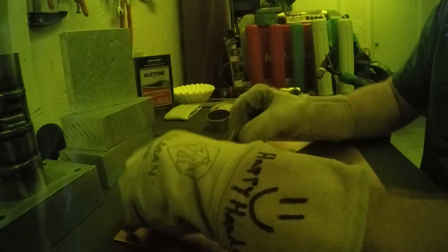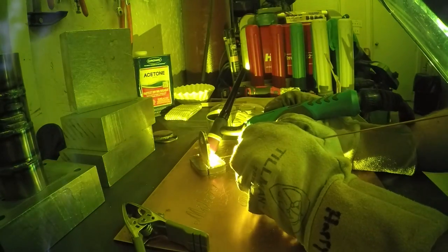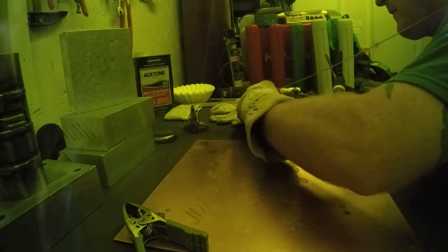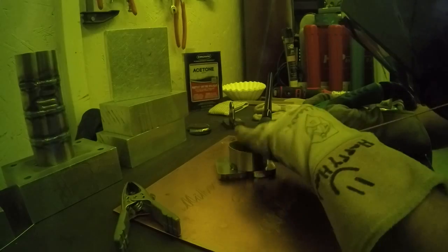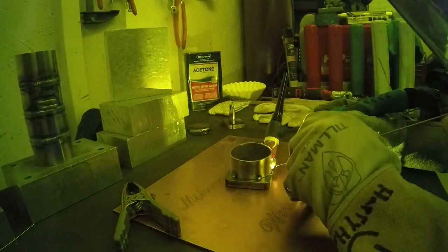Here I'm putting a tab on some 1/8 inch onto some 3/8 inch. I use a little pony clamp to hold it upright — they work really good for that and have a natural V shape, so they're handy to have around. I'm using a number 7 gas lens. Then for the 16 gauge tube to a 3/8 inch flange, I swap out to a monster nozzle — a number 16.